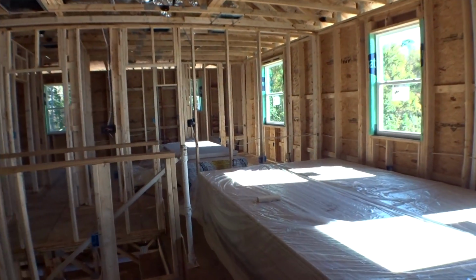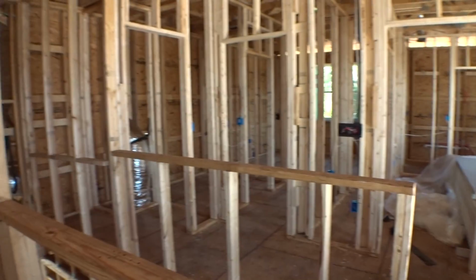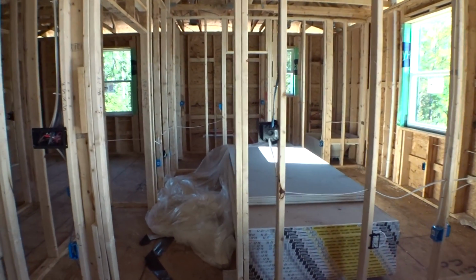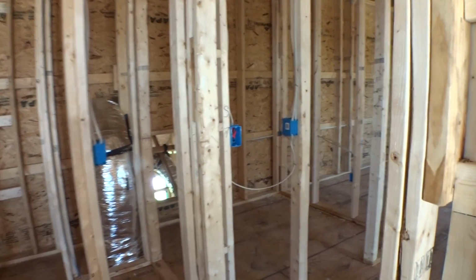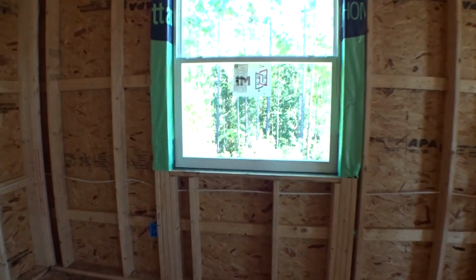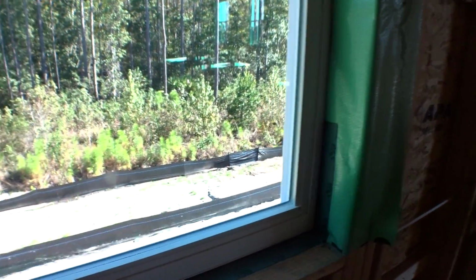As soon as that's complete, they'll start insulating. The county has to approve all that. Get it all insulated before the sheetrock is up, and the insulation gets inspected, of course, as well. Then they sheetrock. Here we go. And get a look at the backyard from up here again. Again, everything's identical, flashed in, wrapped.